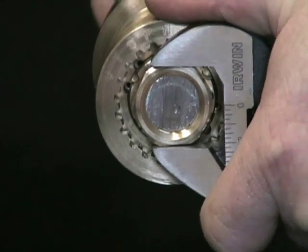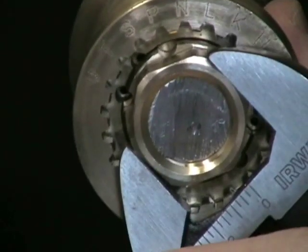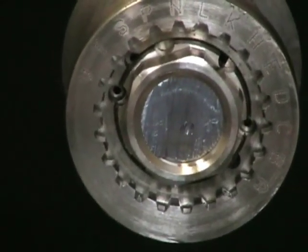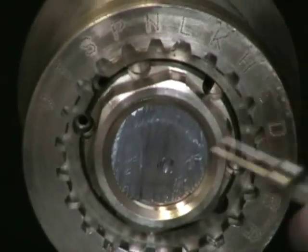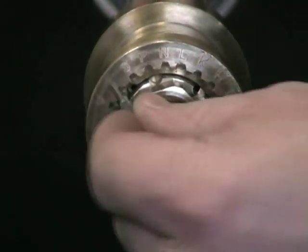When tightening up the nut, you need to tighten it to where you create a complete circle between the half moons on the nut and the half moon on the propeller. That complete circle allows you to put the pins in place, with the flat side facing out.